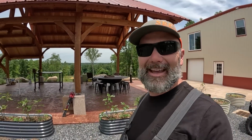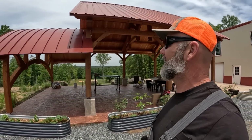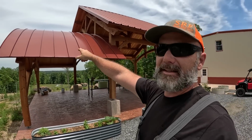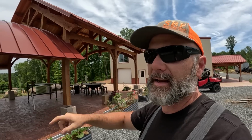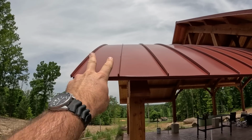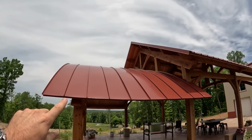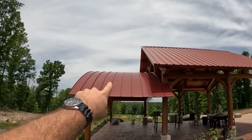All right, guys, everybody has left. Skywalker Roofing has left, and they did a fantastic job finishing up the last portion right here. So we have standing seam roof on this, and we have standard corrugated metal on this. Let's talk about standing seam real quick. I know you got a little information in the video, but there are no exposed fasteners right here. We obviously could not bend standard corrugated metal to fit on this archway right here.